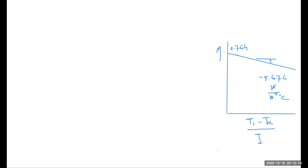Actually, the slope represents FRUL, which is the heat loss coefficient, and the intercept represents the value of FR tau alpha. We have seen these values as we were calculating both the dimensionless x value and the dimensionless y value, and how we made use of that to calculate the F factor, which is the fraction of the energy which is handled by solar.